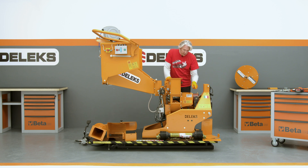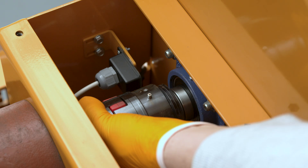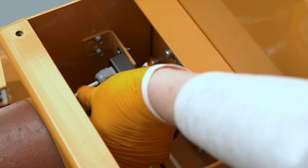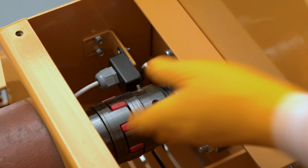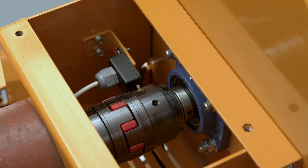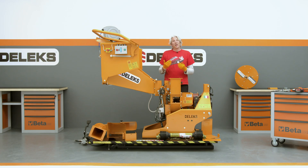There's a final safety feature called the 'no stress' system, which prevents you from stalling or over-feeding the machine. In between the PTO and the rotor there's a rubber coupling that absorbs some stress, and attached to it is a small pin next to a sensor. When the sensor detects the engine beginning to stall, it stops the power feeder, halting material being pushed into the blade and giving the blade time to speed back up again.